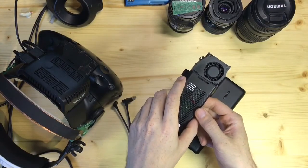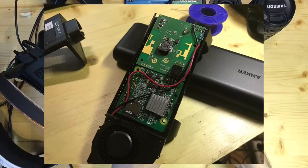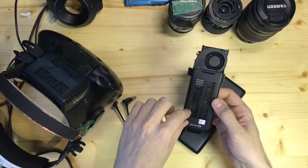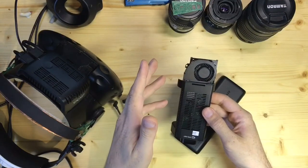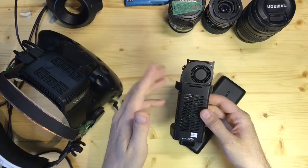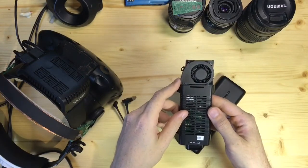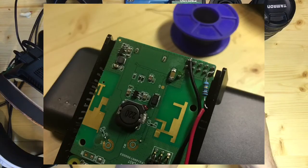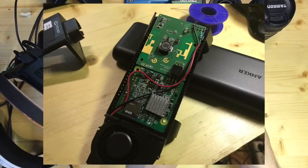The wire runs from the fan to the USB header. I also added a 10-ohm resistor to slow down the fan a bit for less noise, since we mainly need just some forced air movement for the cooling effect. The top row is negative and the bottom row is positive connections — nothing too complicated there. I also tried to avoid running wires over the antenna bands for less possible interference.